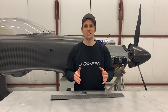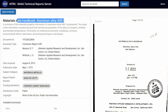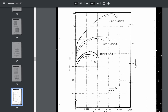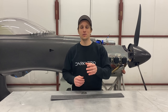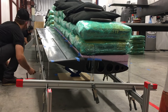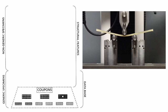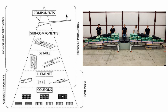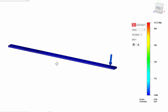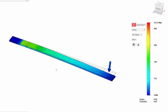Test or be tested. There are a lot of different variables that affect the final material properties of a carbon fiber part. Carbon fiber isn't like metal — with metals there's a lot of published data on its strength under a wide range of conditions. Because there are so many variables that go into carbon fiber, there aren't good sources of published material properties available to use for design. This means you need to perform testing on your parts to verify that they meet the desired requirements. In the aerospace realm, one of the best ways to do this is to use what's called the building block approach — you start by testing small coupons, then work your way up to small sub-assemblies, then larger assemblies, and finally the full structures. Each test article needs to be representative of the materials and process used in your final structure. If you wanted to use an FEA program to simulate your composite structures, you still need some measured material properties to feed into the FEA, and some measured numbers to check your FEA against. There's no way around it — you need to do testing.